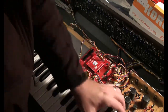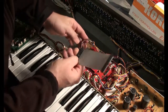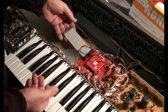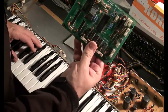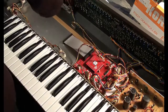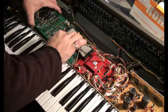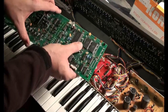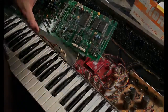This here is a ribbon connector that goes from pin one to pin one with a red stripe. You actually can't make a mistake because it's keyed — this plug is keyed. So this goes in like that, red stripe on top. The keying will ensure that you do it correctly. And then this guy here — he goes in the box, we save him for later. Now over here on the voice board, you'll see it drops right down right about where this microprocessor is — that's the voice assigner microprocessor. So he's got to come out. We're going to head over to the bat cave and get this out using our solder sucker.